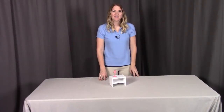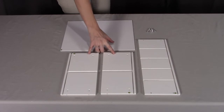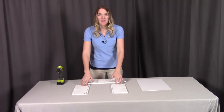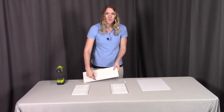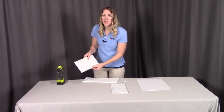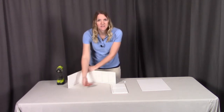Step five is just adding the lamp accessory to the side table. For step six, you need part C3, which is the right side, two of part C7, which is the top and the bottom, part C9, which is the back, and four of the S screws. For this step, we're going to be putting the top and the bottom onto the right side. When you look at the right side, you'll see along the length of it a groove. This groove needs to align to the top and the bottom pieces. When looking at the top and the bottom, you'll see the same groove mimicked along the length of it. You need to have these aligned when screwing the pieces together so that the back can slide in easily.